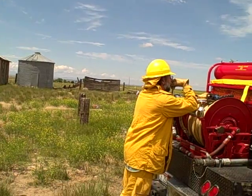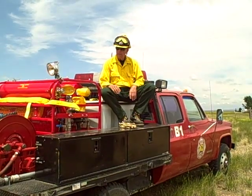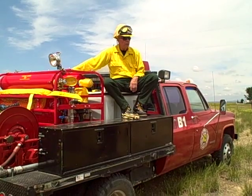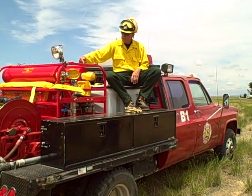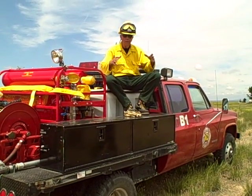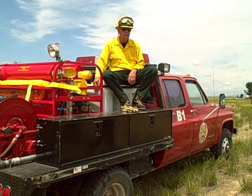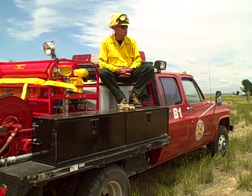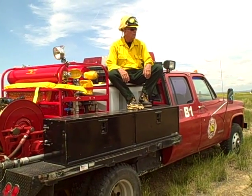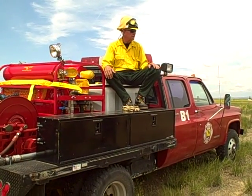He also mentioned there's a way to take water coming out of our fire pump and run it through this system. We'd need a much larger foam reservoir, but using the full 200 gallons plus the 60 here — 260 gallons total — we should be able to generate around 5,000 gallons of foam. That's amazing for a little outfit like ours.